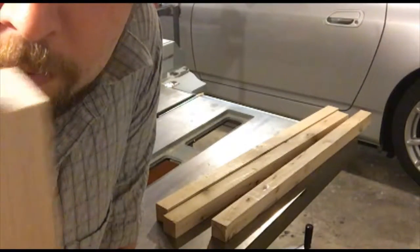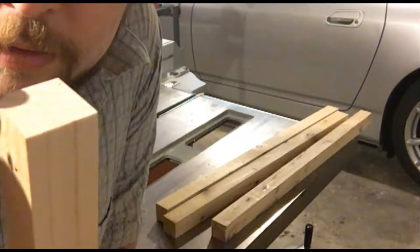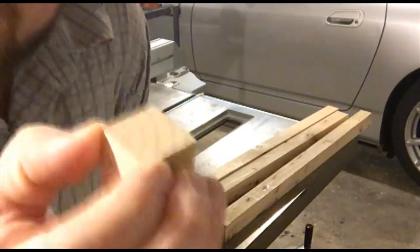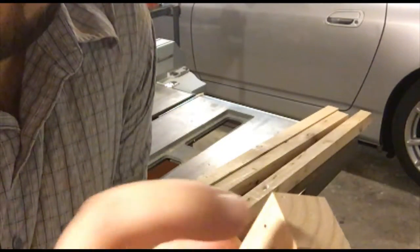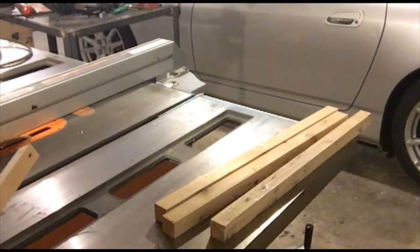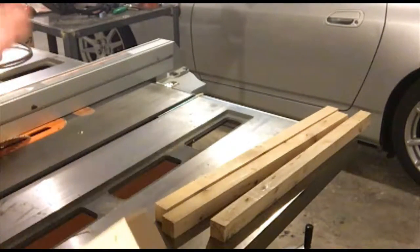So to take this down, I want to cut off a third of each side. There we go. On each pass. So there'll be a third taken off, third left, a third taken off. The saw is at 45 degree, because when you have 90 degrees, you take off 45 degrees, you get an octagon.